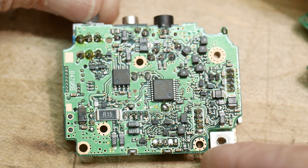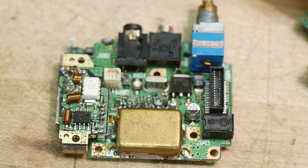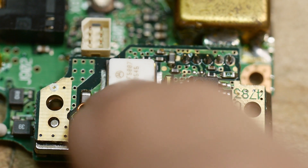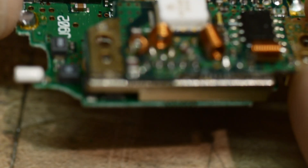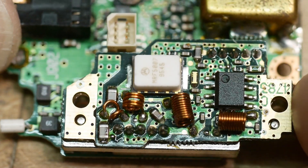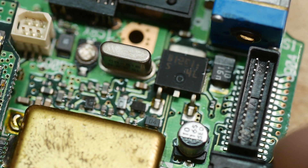Let's get even closer. Lots of stuff in here. I think this is the final amplifier — I think that's the final transistor there. And this looks like the low-pass filter on the output. The antenna would connect here. This is kind of a three-dimensional thing too — there looks to be a giant heat sink in here, a big slab of copper that attaches to and goes underneath that transistor. And there's something under a can here — I'm not quite sure what's under there. Maybe a FET here for power on/off — that's my guess.